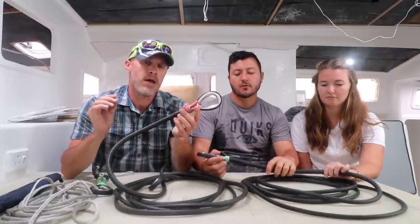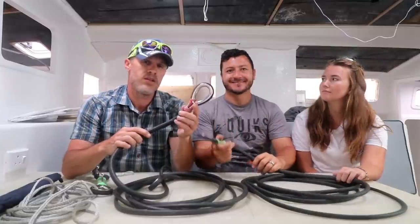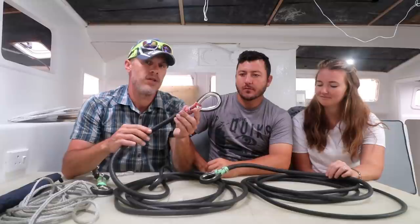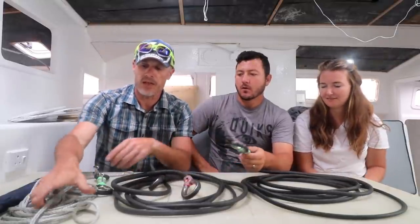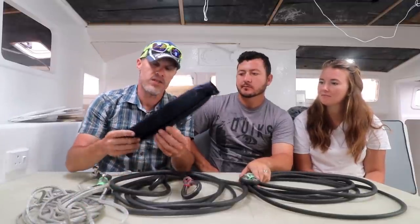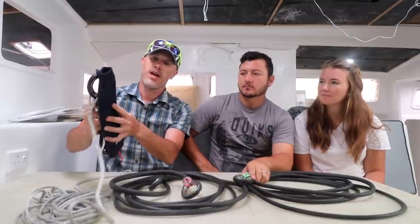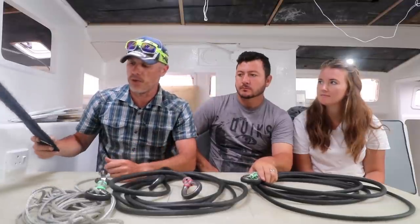There'll be maybe a minute amount of stretch that we'll get from the first month or so of sailing, of loading at sailing loads. And then beyond that, the creep in Dyneema is extremely minuscule. So once we get the lashings up and frapping knots tied on really tight, I've got these covers, and these are off-the-shelf turnbuckle covers, but they perfectly fit the deadeye to protect that. There's a lot of dirt in the shipyard environment, so we want to protect them.